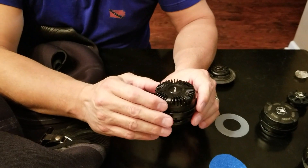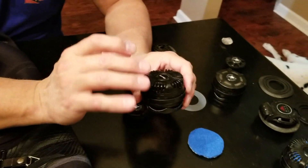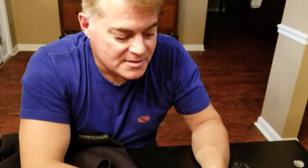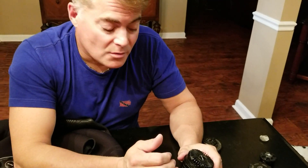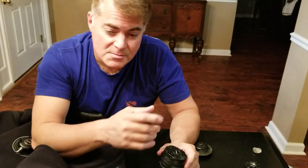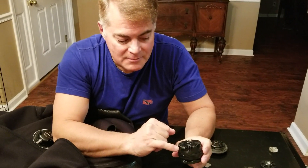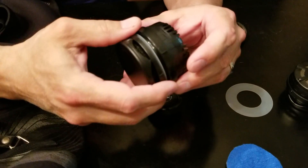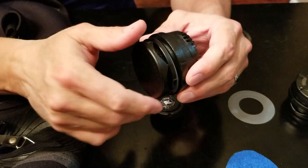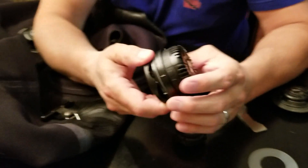The problem that I had as a professional diver is that I was diving in salty, muddy, nasty environments. I would be scraping barnacles or using an underwater chainsaw. There was particulate in the water — lots of sediment and junk — and that stuff would kind of get in between the vanes here, go into the valve mechanisms, either in the adjustable valve or in the check valve. And it would make these leak. So we had a valve that simply wasn't reliable.